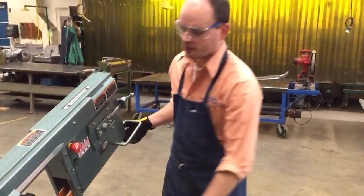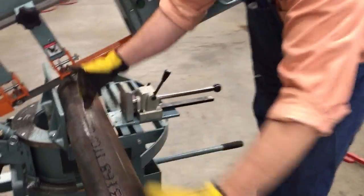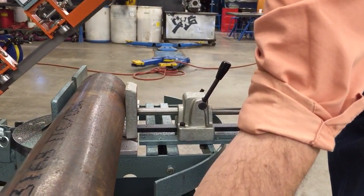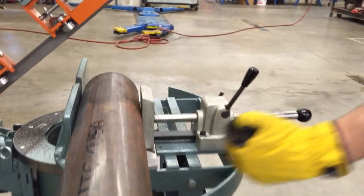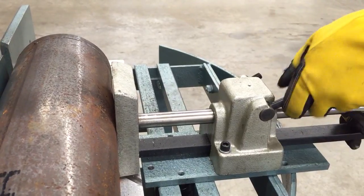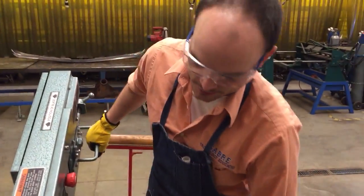The basic operation: we have a bandsaw that lowers down onto our cutting material and it's adjustable. We'll go over that in a minute. We have the base and the material we're actually cutting here. This is a clamp that we use to secure the material onto the table so that we get a good cut. I'll position this for a 90 degree cut. I push this all the way over and then there's a lever that pushes it in another eighth of an inch — you can barely see it move but it's under a lot of pressure so the material doesn't move. Especially round pipe, it'll twist on you.